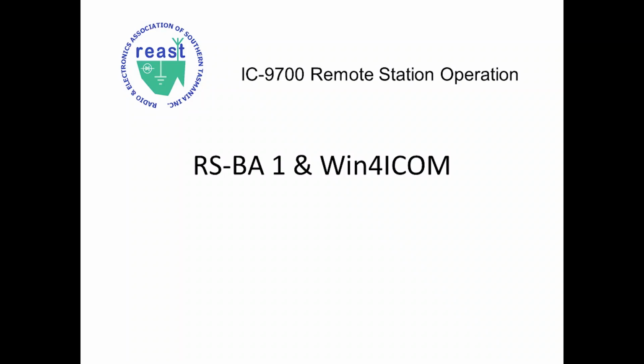So this is remote station operations. So there's two primary pieces of software. I'll talk about the RSBA1 software, and Larry will talk about Win4Icom. So the RSBA1 software is the Icom version of remote software. So it comes from Icom. I think it's about $120 Australian, and that is what the Ethernet port is for on the radio.